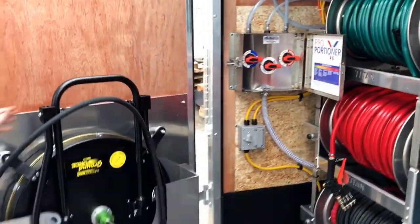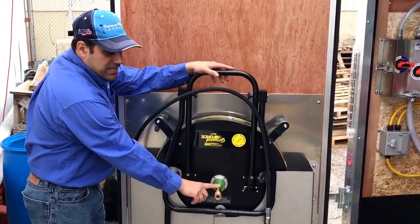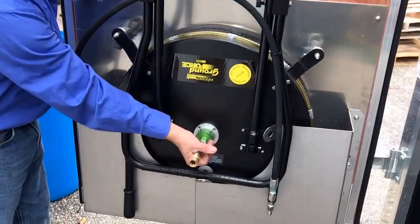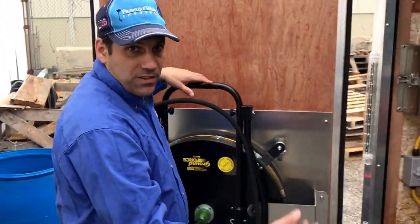On the surface cleaners here, we installed a high-pressure canister filter, and this will help him keep debris out for when he connects and disconnects the hoses, preventing tips from clogging up.